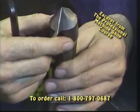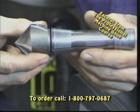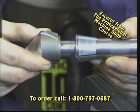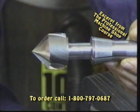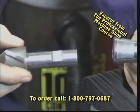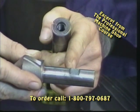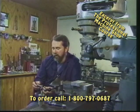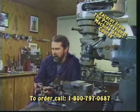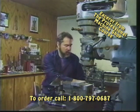Ideally, if we were going to use this V-block form cutter, we want to choke it up really close to the collet. But if we have a deep hole to reach or a hard-to-get place, we can pull the collet out within reason and expose more of the cutter — though we're losing a little bit of rigidity. A good rule of thumb is one and a half times the diameter of the shank. Anytime we extend the cutter out, we want to slow down our feed rate and take a smaller amount of material off, because we've lost some rigidity in the holding process.